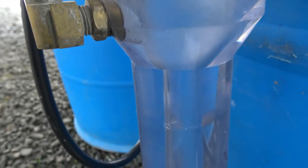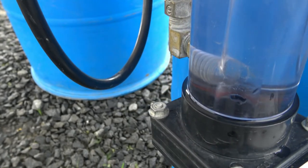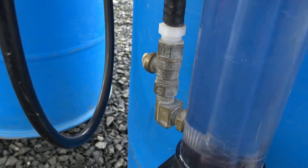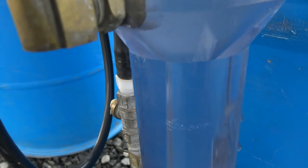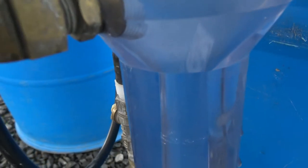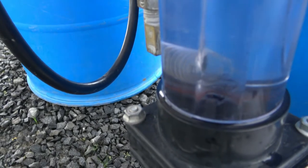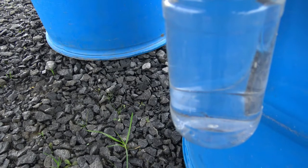This is what I refer to as the drop tube. This valve here controls the flow of water traveling up, supporting the ore in the trap, then settles the gold down through and drops through the drop tube and into the waiting collection jar.